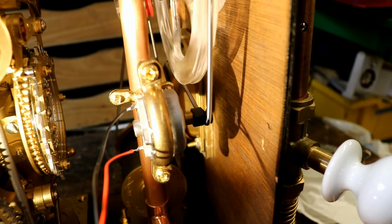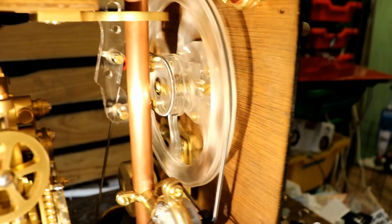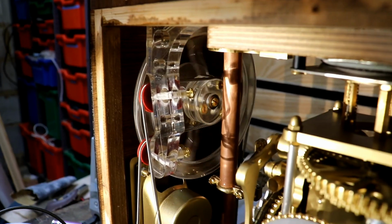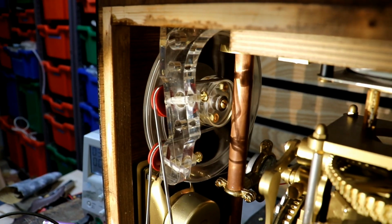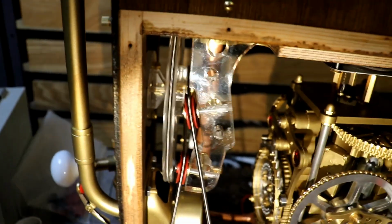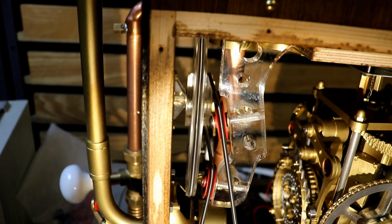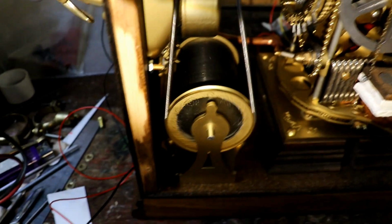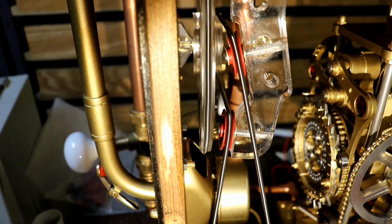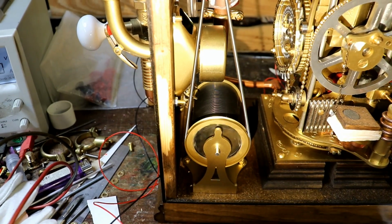This is so exciting. I've got a couple of wires soldered onto this little motor, and that's running that bigger pulley that's now not got any nuts sticking proud of it. So from the back we've got the big pulley turned by the motor, the little pulley in the centre pulling over these two, and that thing I cut out works perfectly. The spring is perfectly aligned, so the top one comes down there, round the back of the phonograph cylinder, and then back up, back to the original pulley. And it's turning. It's fantastic, so exciting.